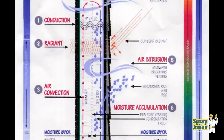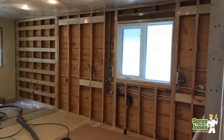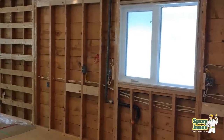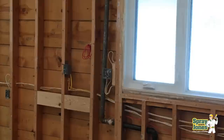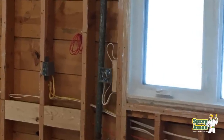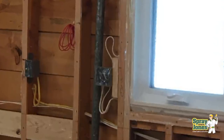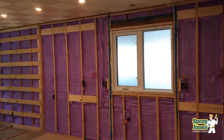In older buildings the air leakage and heat loss rates were so high that the buildings rapidly expelled air with moisture out of the structure, staying relatively dry. This is why we've opened up 1947, 1957, 1967 walls and they are dry and not badly damaged — the heat loss rate was so high. However, I've been dealing with people in the last 15 years who tell me their house has been fine for years, but recently the walls are wet, they're having condensation issues, and literally have mold growing inside.